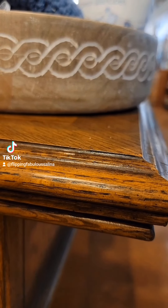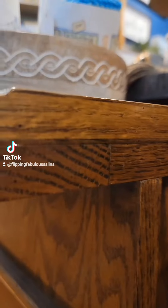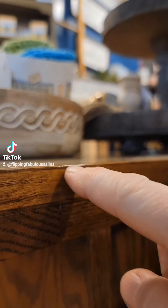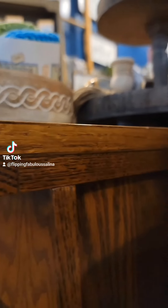Going around back, you'll see that the top is composed of two layers of wood, kind of patched together. There is a wood veneer, and veneer is just a thin sheet of wood — usually a nicer piece of wood going over lesser quality woods, historically. Veneers can be sanded down and stained; you just have to be careful not to use too aggressive a grit because if you do, you can sand through it.